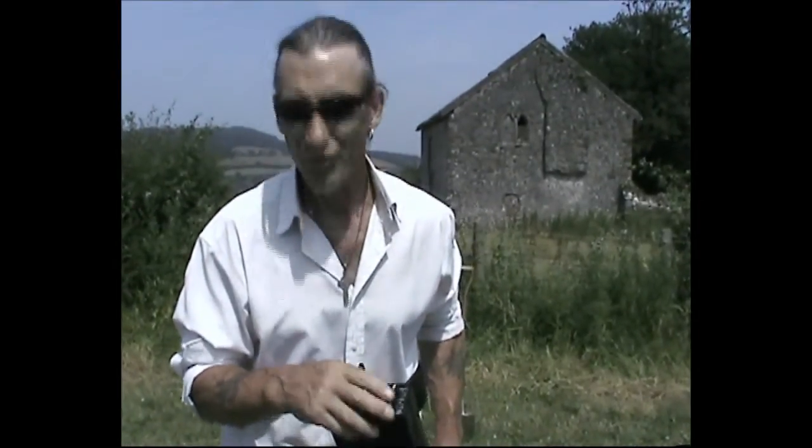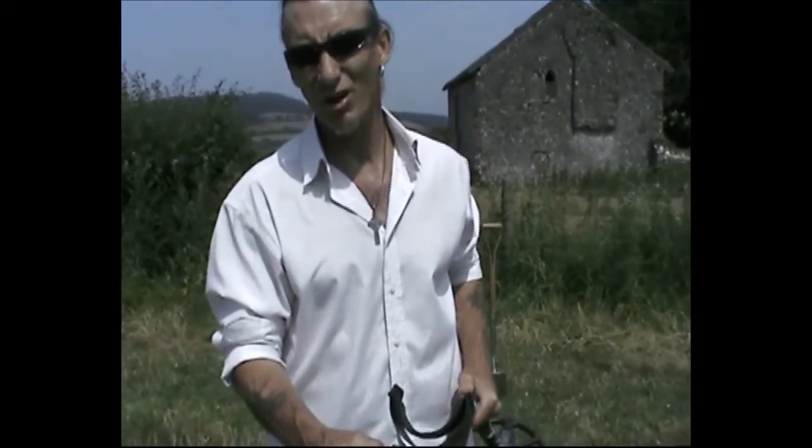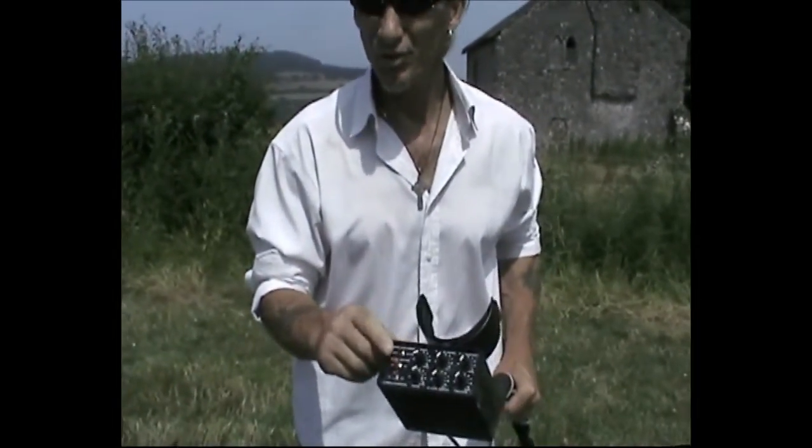Your frequency can be used to calm your machine down if you've got interference somewhere, or if you've got another BLISSTOOL around about, just go from maximum to minimum, or vice versa. Your volume is just that, your volume. You have ground coarse and ground fine. That's for your manual ground balance. I'll take you through those now in a moment.